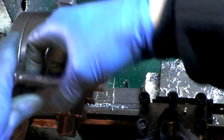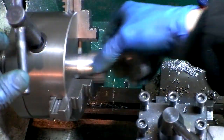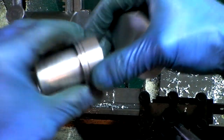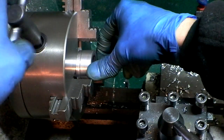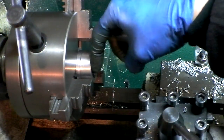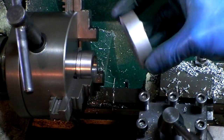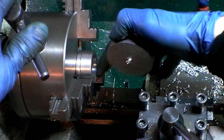You can see I mounted it on the spacer that we talked about before with two little spacers. My Z is zeroed on the face of that, and I pre-drilled it for a quarter inch, just manually. That'll help the boring operation.